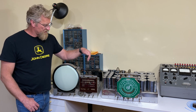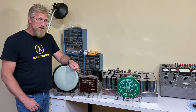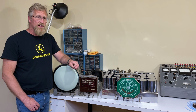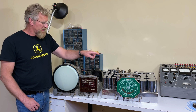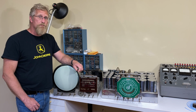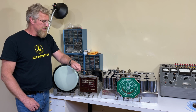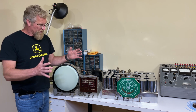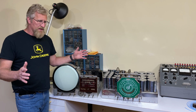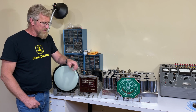What they do have is sides that bend and lip in on the chassis. So I needed to design a clamping system so that I could clamp down on that lip on the bottom and hold it safely and securely in the chassis stand. I also wanted the stand to be able to expand wider and go narrower, so I can accommodate different chassis sizes.